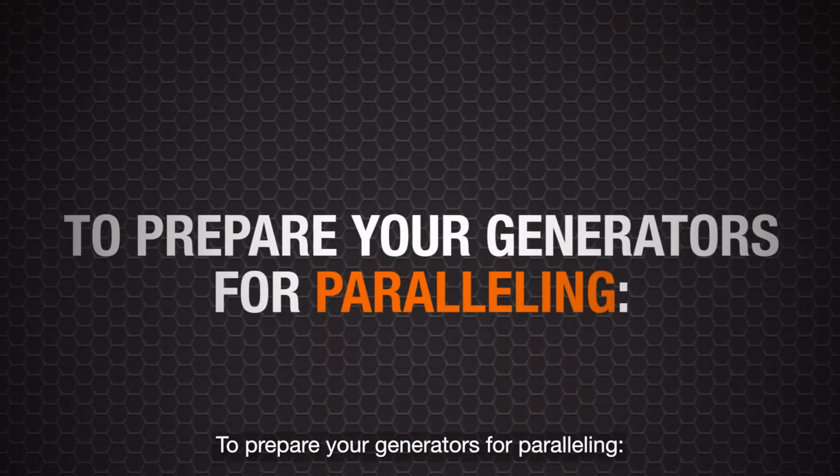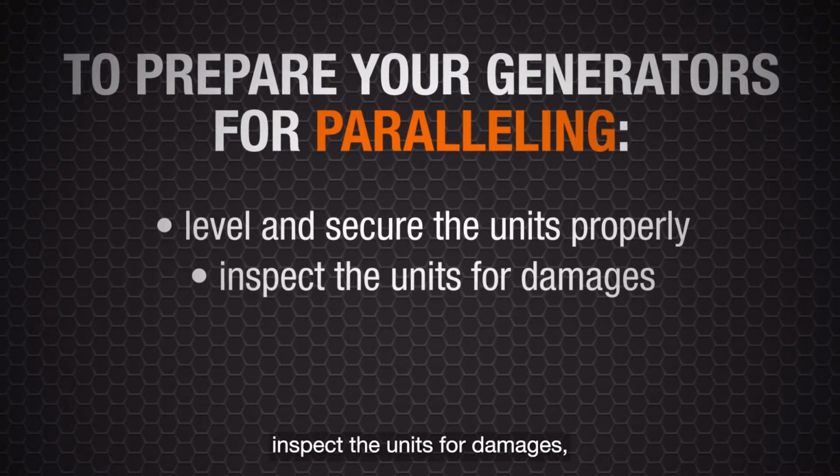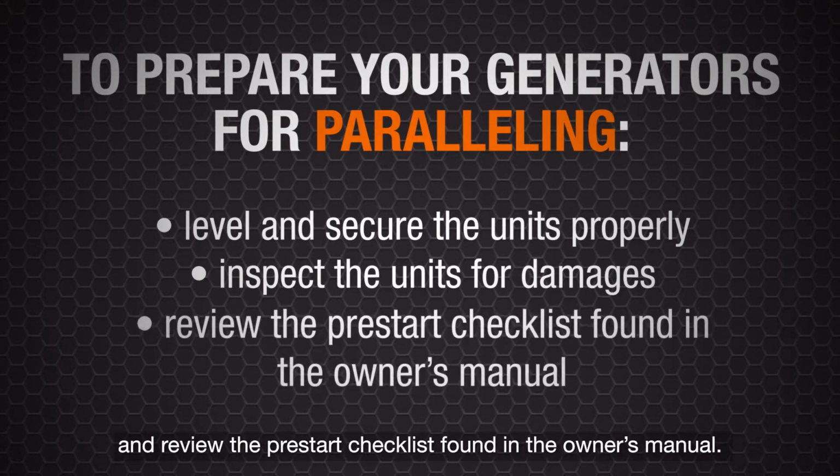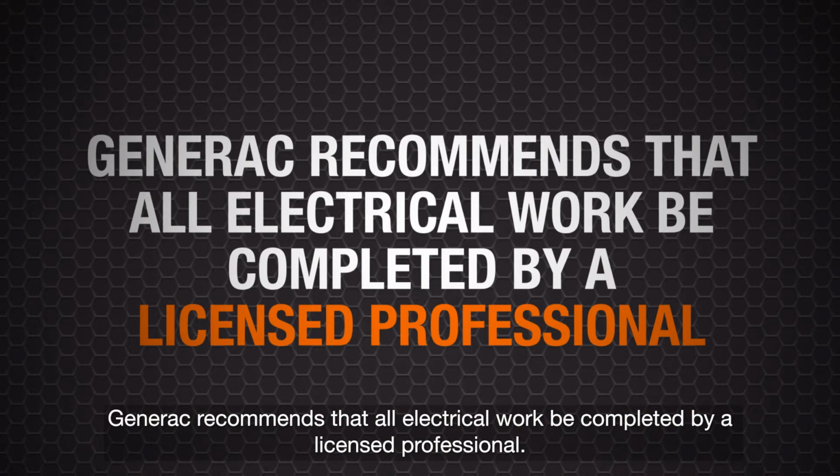To prepare your generators for paralleling, level and secure the units properly, inspect the units for damages, and review the pre-start checklist found in the owner's manual. Generac recommends that all electrical work be completed by a licensed professional.